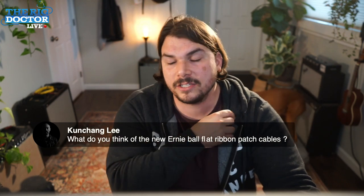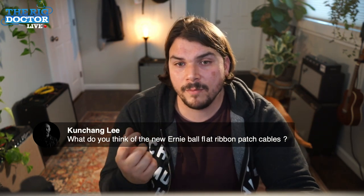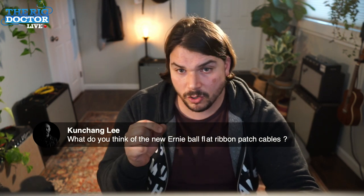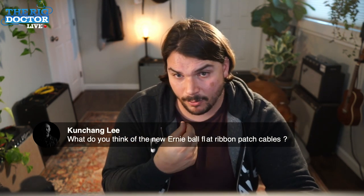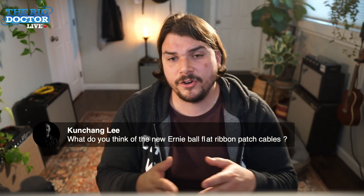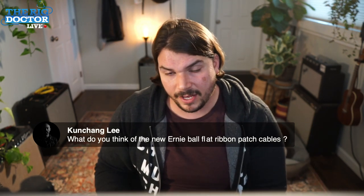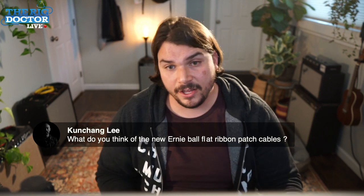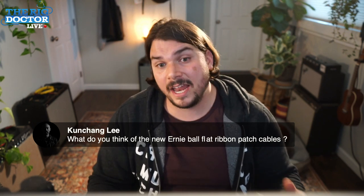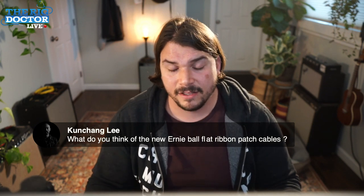And how I tested it, just so you have a sense, is I took, I think I had 8 of them, and I put them into a Boss ES8, and I just looped them, like send into return. So I just took one cable out of the send and plugged that same cable into the return. And I turned on all the loops and I just listened to what it sounded like, because I couldn't get one that was long enough to really evaluate it. And then I used a 3-foot instrument cable going into the input. I turned off all the buffers, and I used a 3-foot instrument cable going out of the output. And so I could really test what it sounded like. I didn't have enough where I could get a 3-foot Ernie Ball going into the amp. I used up all the ones that I had in the loops.